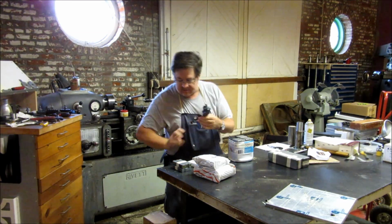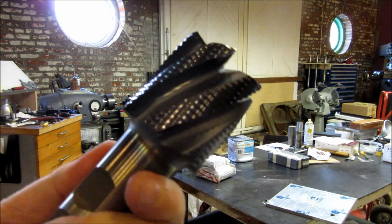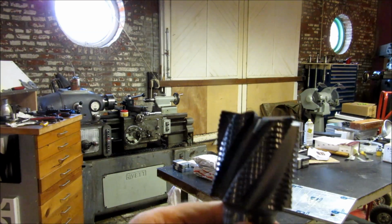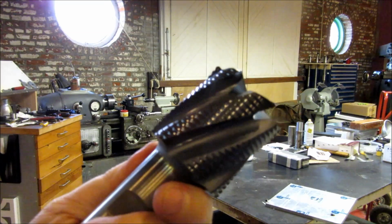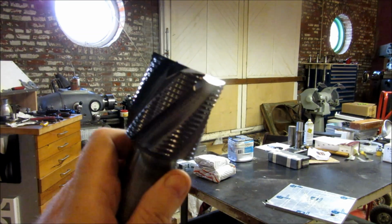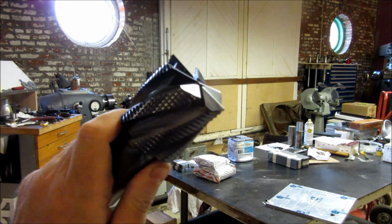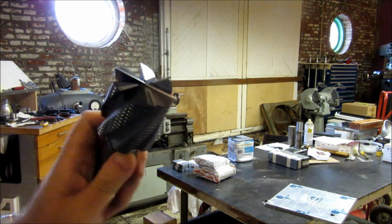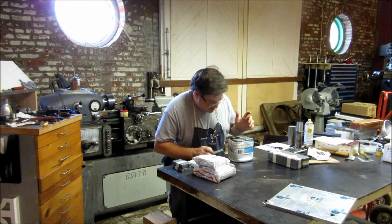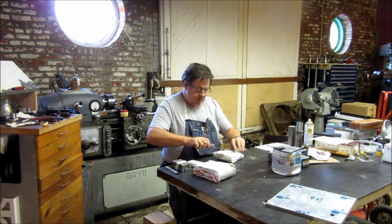All right. Again, let's move in here. This is a 2-inch, 6 flute rougher. That's a fine pitch rougher for an end mill this size. Coated with a 1 1/4 shank, which is one of my favorite shank sizes for the big mill. It is a square corner, which is okay, but this is a great buy here. Got 4 of these things. Got a great price. Again, that's not something you might normally look for.